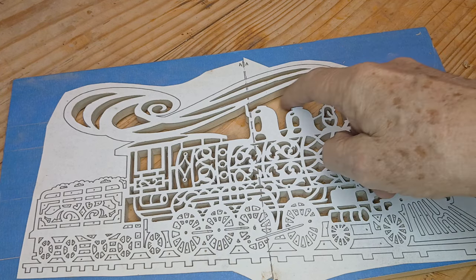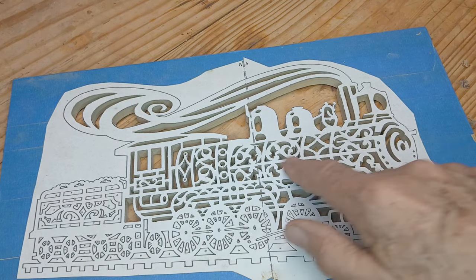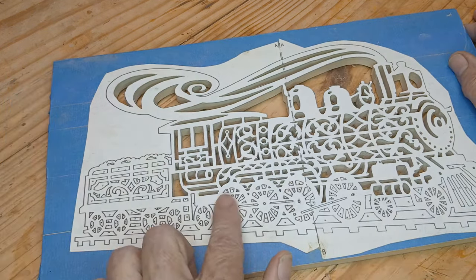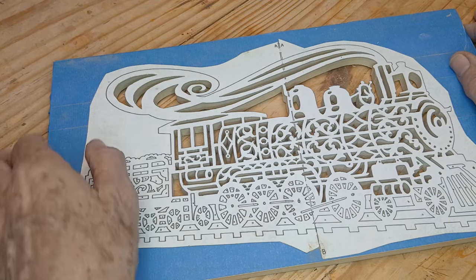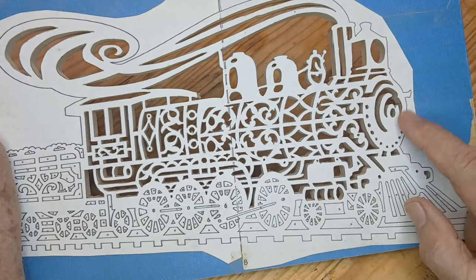What I did on this one — these larger cuts I cut out with a 5. When I got down in here, some of these can still be cut with a 5, but I generally got down to 3s and 1s. I don't cut this all in one sitting, so I'll choose a section I'm going to cut that day. I'll say I'm going to do that wheel — it's not impossible to do some of that with a 5. But density and thickness is not really a consideration here; it's just the size of the cut, the intricacy. These aren't real intricate, but you get into something like right here, or over here where these bolts were — I cut those with a 1.